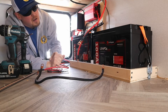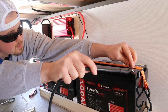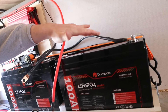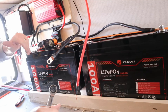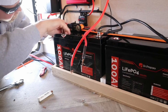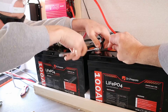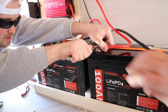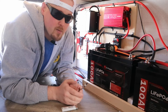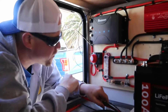The batteries aren't going anywhere. Now we're going to get our batteries all wired up — we've got our negative hooked up and we're going negative-to-negative and positive-to-positive, which gives us our 12-volt system. We have our positive on one battery and our negative on another battery for the inputs. We're then going to go ahead and hook the camper leads up to our bus bars.